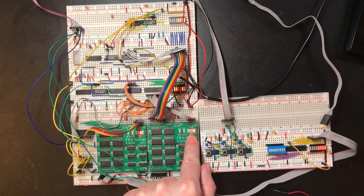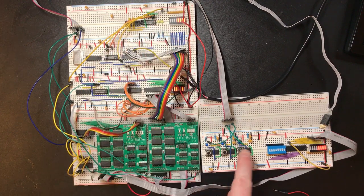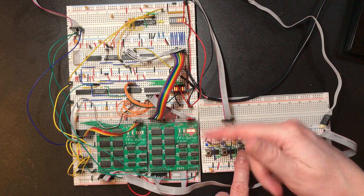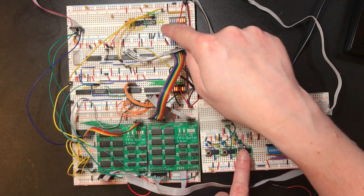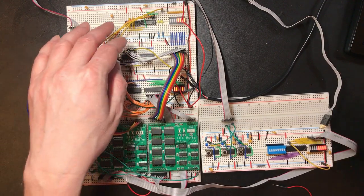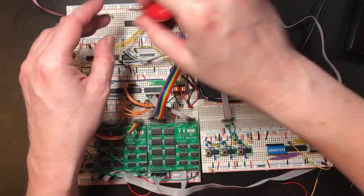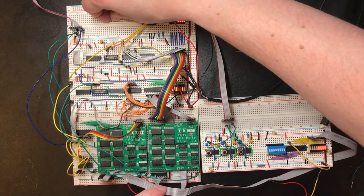Okay, so this value is currently non-zero, so it's on. Let's reset. It's gone off. Let's queue a byte. So I effectively pressed the transmit button more times, and that is actually valid because this is showing a value more than 8. But wrap it round, and yeah, that works. All right, that's good. Now we can get rid of this edge detection circuit. I must admit, it never feels particularly satisfactory when I use inverters to delay like that.